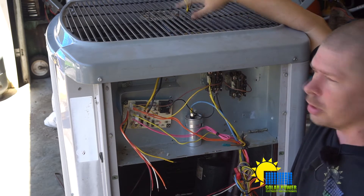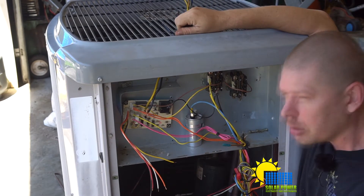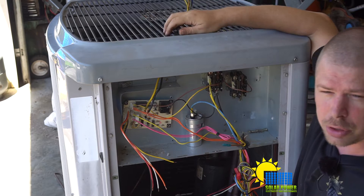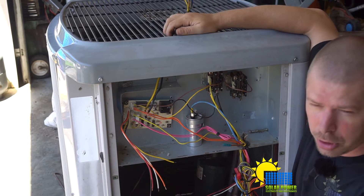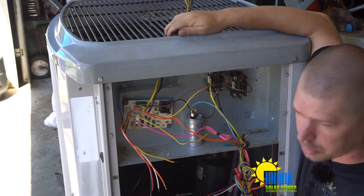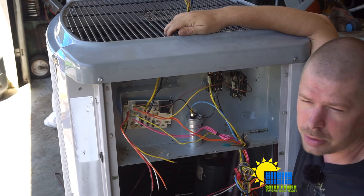So I'll put the coil on top because it's a big slab coil - I'll blow the fan through it and we'll see how much pressure there is. I'll run some refrigerant lines to it. It's got a two and a half ton coil, a two and a half ton thermal expansion valve designed for R410A refrigerant. We've got to make sure we're not overcharging the system or putting liquid in it, so we've got to make sure we don't have liquid going back to the compressor.